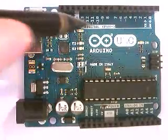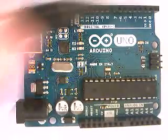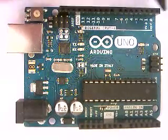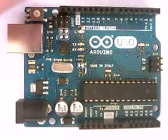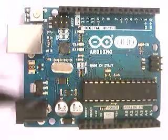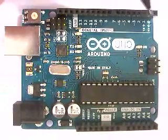We're going to ignore these ICSP pins because they're really not important to anything you'll do with Arduino most of the time. Starting at pin zero: it has an RX label with an arrow pointing in. TX and RX are what's called UART — a universal communication standard, basically what USB uses. These two pins can actually replace a USB cord if you have two Arduinos or other devices communicating with each other.